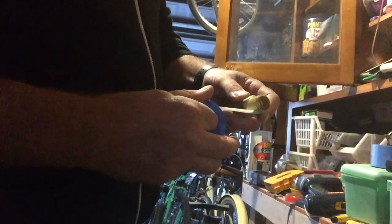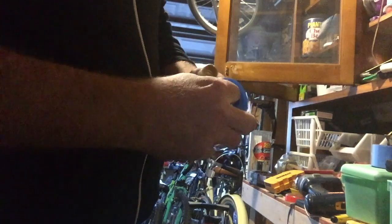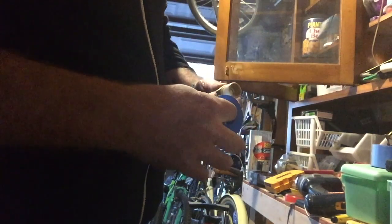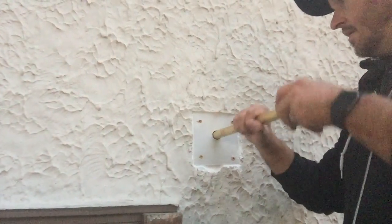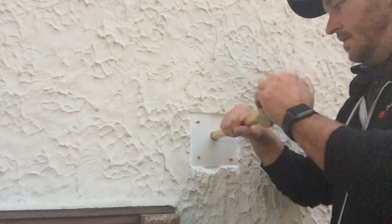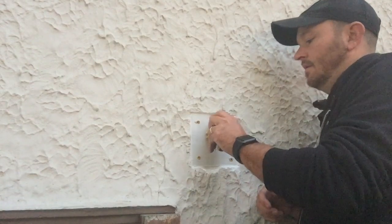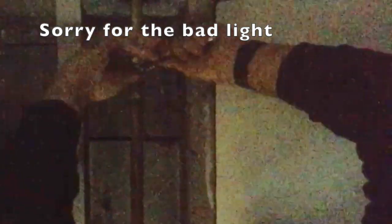Because the pipe on the spigot has a male connector, I went ahead and wrapped it with Teflon tape, making sure I was going in the proper direction, and I did three full turns around it. This can be a little tricky to get started, but once it grabs on, it's pretty straightforward. Then I carefully fed this through — the part getting stuck is actually where the wrench attaches, so it wasn't affecting the Teflon on the threads. I got that lined up and marked, then I wanted to tighten it down. That's why I cut the pipe before — so I could come in and thread it in there.